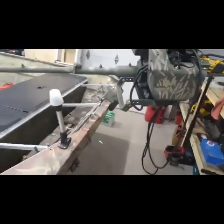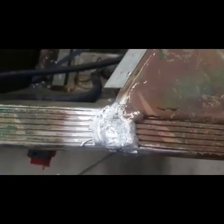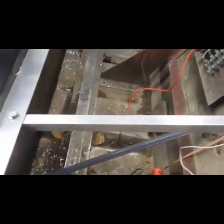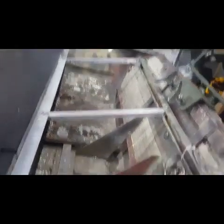It puts an awful lot of torque on that transom. Well, it created two cracks, one on each side, and you can see I already brazed those together — sorry I didn't get it on video. And then I did the same thing on the other side there, as you can see. Then I added this reinforcing, which is just a piece of aluminum angle riveted to the bench seat, and I've got some three-quarter inch aluminum tube kickers going back to the transom — there are three of them.